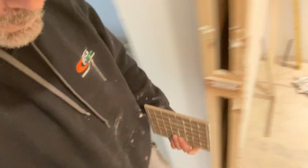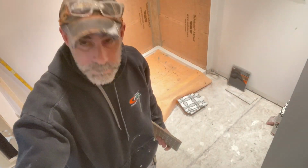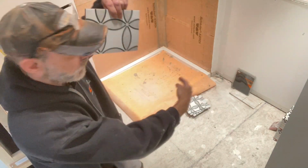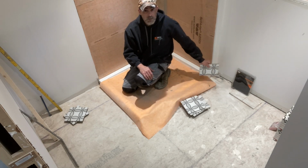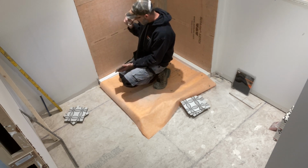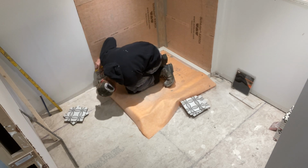I'm just going to set my camera back here. So that's going to be my first course. And I'm also, like I said in my first video, going to do a return in there. It didn't call for it, but I think it'll look a lot better. So put your tile on that shower pan and just mark it.